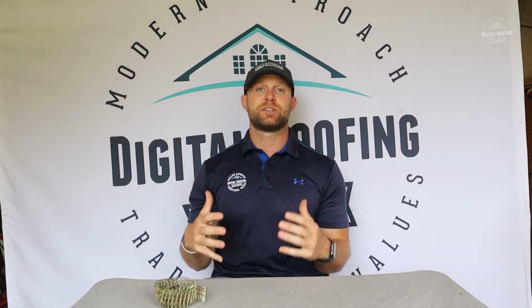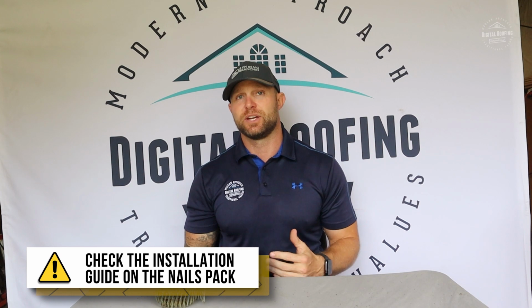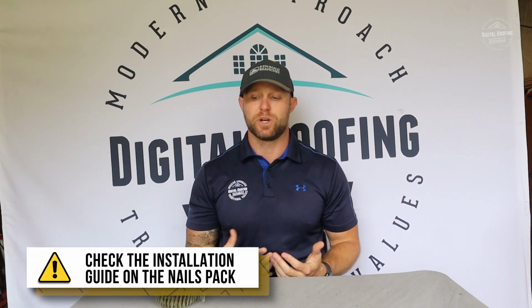Okay, so that's it. I hope I wasn't, again, too long-winded on this. I think it's very important to understand why you need to make sure you're at least getting 4 nails per shingle. And if there's ever a question, every single one of the packages that these shingles come in has an installation guide, and they all have reps that you can call.